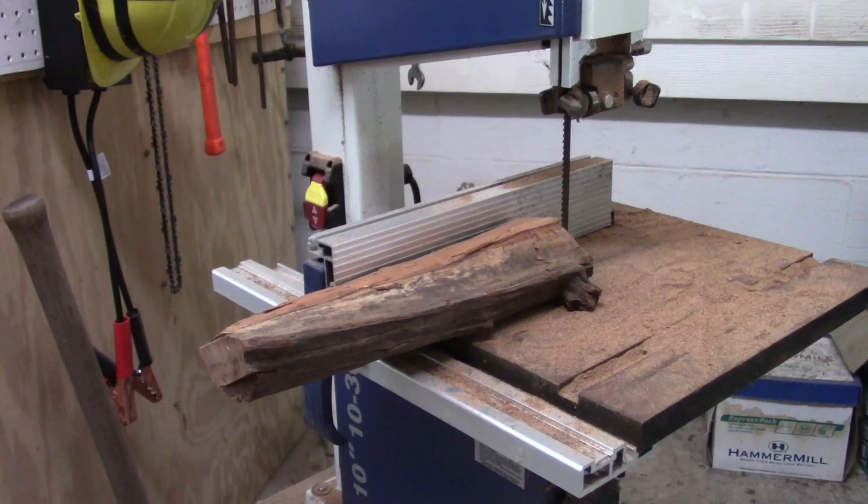One thing I'm going to do in this approach to making shot is to cast a flat sheet of lead and then cut it — that would be more or less a traditional method. But I'm going to try one more thing: I'm actually going to make a mold out of wood, which is well seasoned, and see if we can't cast a rod that's more or less a quarter inch. Then cut that rod into shot-size pieces, which would be far easier than cutting sheet lead.